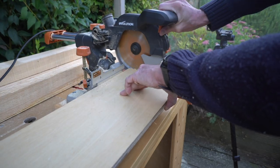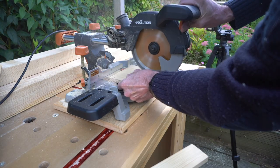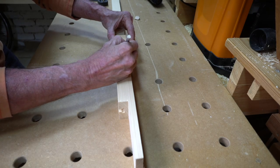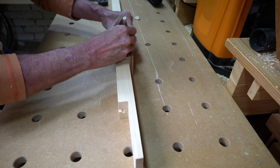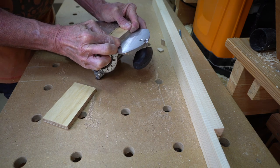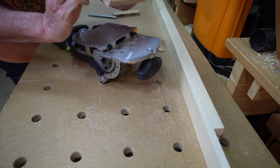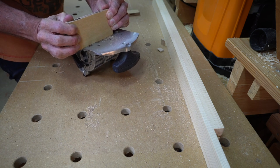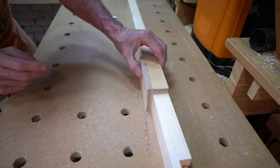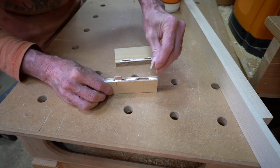Next, to make my stop I need a couple of pieces of plywood — here I'm using some offcuts of 12 millimeter. It is now noticeable with the darker evenings and cooler mornings that I'm spending a little bit more time each week inside the loft workshop rather than playing outside. Using Jason from Bourbon Moth's IP thrusting method, I inserted a couple of dominoes to join the two pieces together, finding that the four millimeter domino worked perfectly with the 12mm plywood. Once I'd ensured the stop was the correct size, I applied some glue and a clamp and put it to one side to cure.